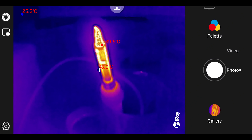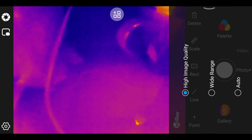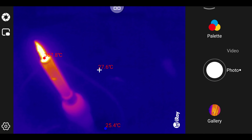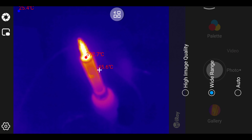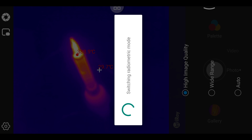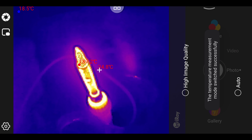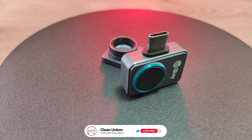For last, what you see here is the tip of a soldering iron set to 480°C. On the normal range it was only showing up to 189°C, but when you switch to the wide range it unlocks the 550°C range — now it's showing 387–390°C. I'm not sure if it's the fault of the soldering tip not completely heating up to the correct temperature, or a calibration issue, since you can manually calibrate for environmental circumstances. If you liked it, don't forget to like and subscribe — see you in the next one.